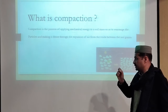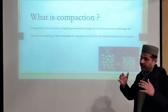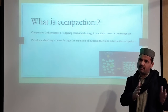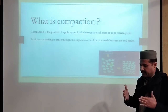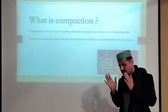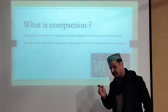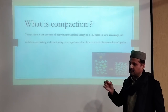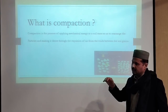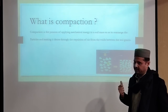The basic aim of this example is to illustrate compaction effort. When the compaction effort is greater, we provide more energy to the soil mass, and as a result, a higher maximum dry density is achieved. When dry unit weight is increased, the engineering property — which is the strength of the soil — is also increasing.